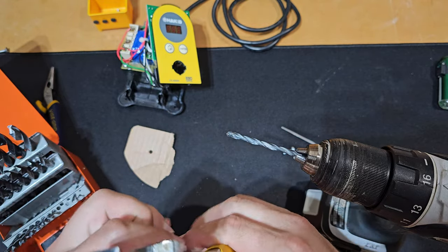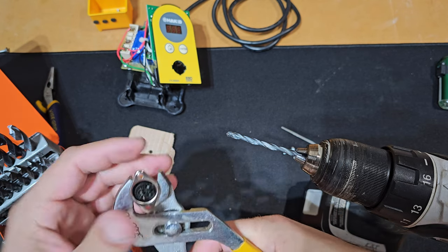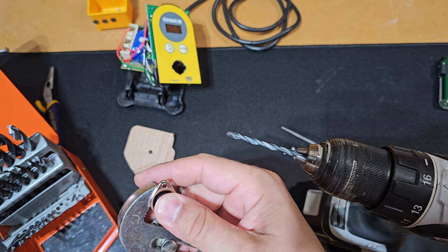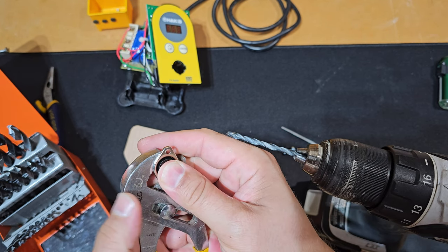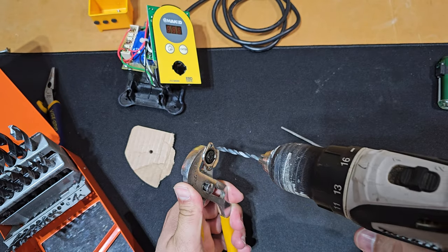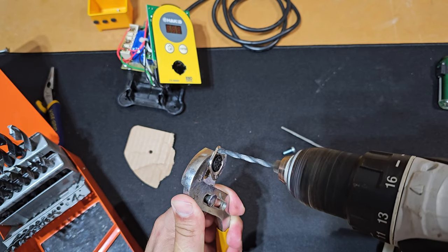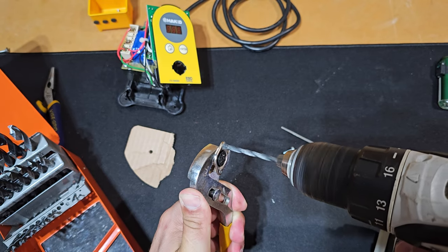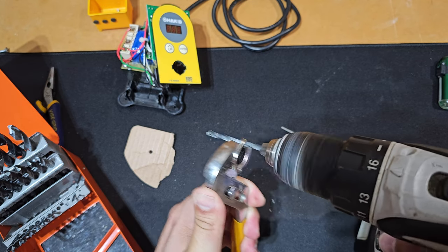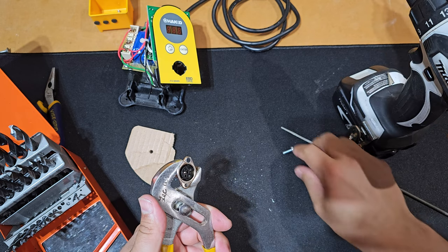The next thing that I need to do, and I've already figured out what type of bolts I need, is I actually need to widen the holes for the bolts to fit through. And the drill, as you'll notice from the video, is actually going counterclockwise, and that's intentional. That's not accidental, so don't blow up my comment section. The reason why you do this is typically I'm eating less metal as I'm drilling through, right? And that happens because you can see how thin the sides are.